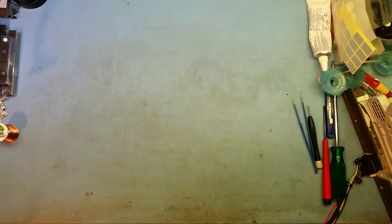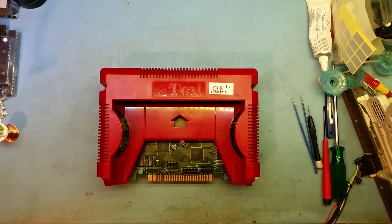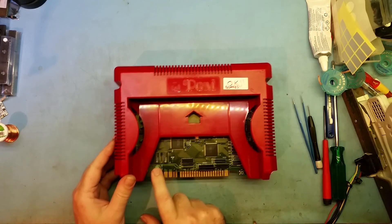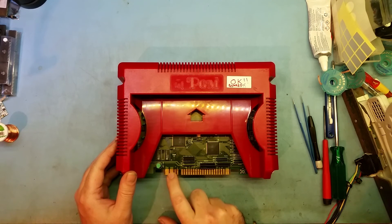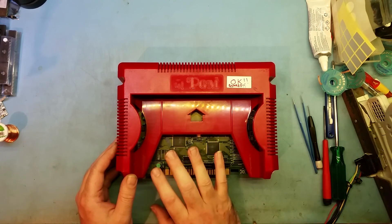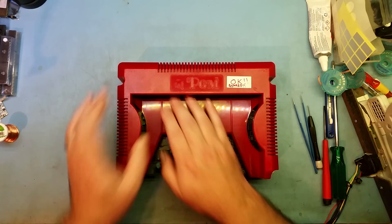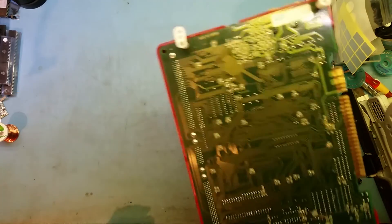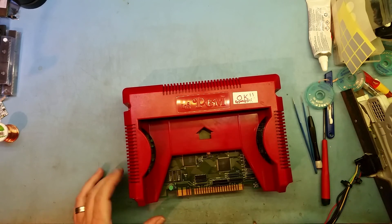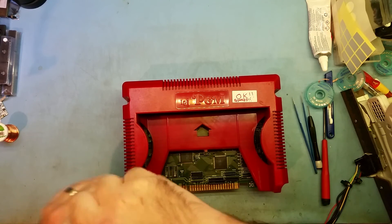Now, one thing you've probably noticed from my previous videos — I mentioned the location of this cap. It needs to be in the other spot, just above the power fingers on the JAMMA connector. Those are the ones to go for. If you've noticed, all the boards in these videos are pre-version 9, so the cap will be in the wrong spot. These are all the ones that are going to have battery damage.